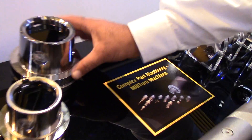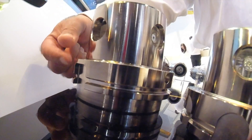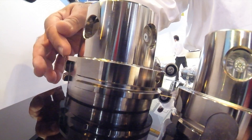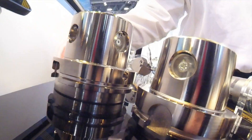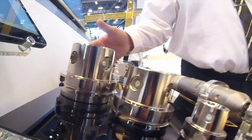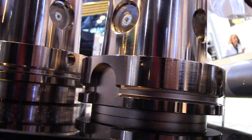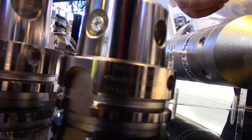Another thing that we also did is the flange width and the V-groove on the flange are the same DIN standard as HSK. So what we've been able to do is retrofit HSK machines out in the field when customers want stronger connections. We've done about 60 retrofits in the field of former HSK machines to KM4X100 connections.